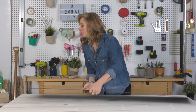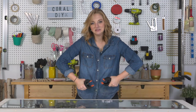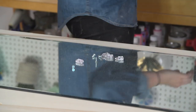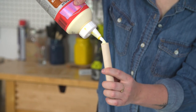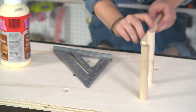This looks amazing. Let's get our mirror on top before we put our dowels in. Just so that my mirror doesn't move I'm actually just going to clamp down the bottom. You can pick up a small mirror hanging kit from your local hardware store, but the screws that come in the kit are actually going to be too long, so I've just picked up 5/8 inch wood screws and they did the trick. Now take wood glue and apply it to the bottom of your 6-inch dowel and a little bit inside the groove, then plunk it in. I'm using a right angle to make sure that it's a perfect 90 degrees. It should dry very quickly but you might just want to hold each one until it sets.